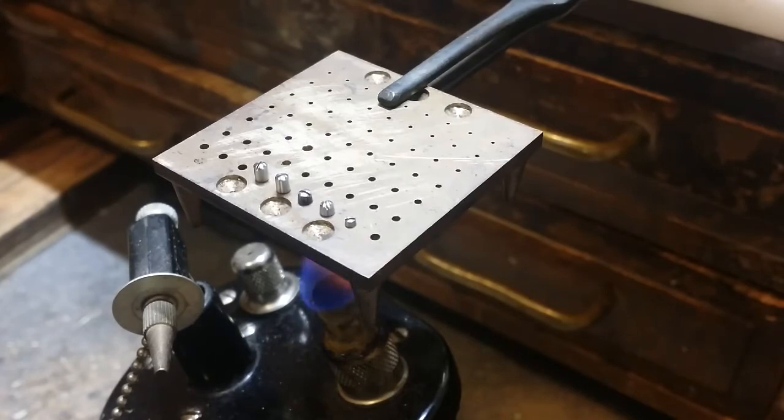And I did preview that piece of video, and you couldn't see it very well on the video. Just looked like a big ball of fire. But you heat it up to a certain glow or a certain temperature and then quench it in oil. And it takes it from the dead soft state to a state of glass hard.